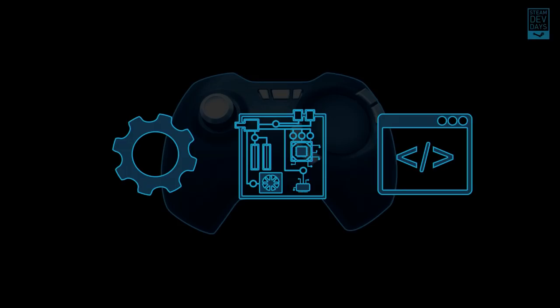Trackpads were another obvious target because we had seen them reliably recreate absolute input in the form of a mouse on laptops. Even though we hadn't had good experiences playing games on laptops with trackpads, we still wanted to explore the space. We started building our own trackpads, figuring out what makes existing trackpads bad and what makes them good. Through iteration, we learned there were a lot of improvements over trackballs — no mechanical moving parts, no dirt and dust problem, and freed-up internal volume for other interesting electronics and processing.